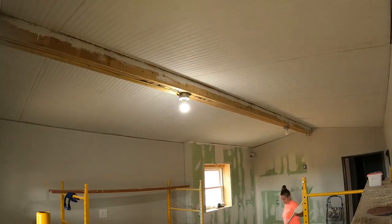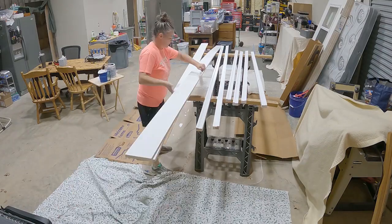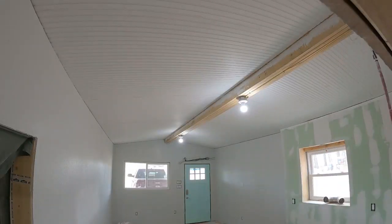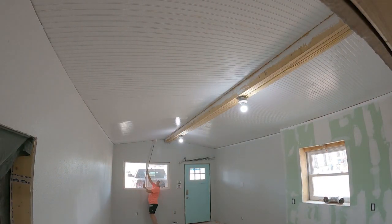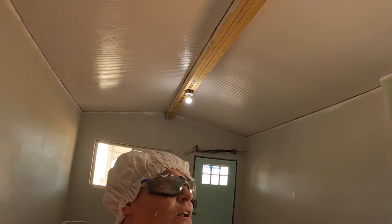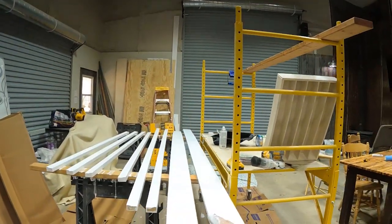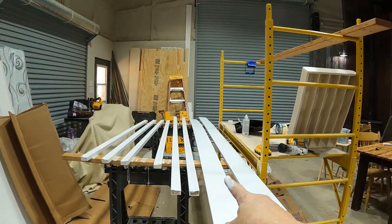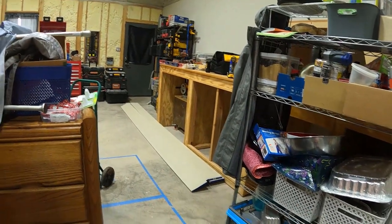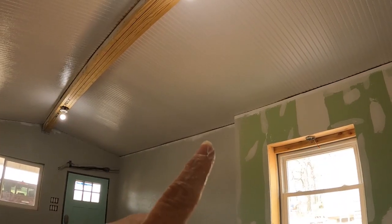Okay y'all, I just finished two coats of ceiling paint in here. I already had two coats - Pops filled in the gaps and sanded, I wiped it today and put on two more coats. Then in here I painted the rest of the baseboard and ceiling trim - the brick mold that goes along the beam. Pops picked up the beam wood yesterday; when he gets home this weekend we're going to hang it. Obviously I'll have some touch-up paint to do - there are a few places I can already tell need some caulking and paint, but that's all by hand.